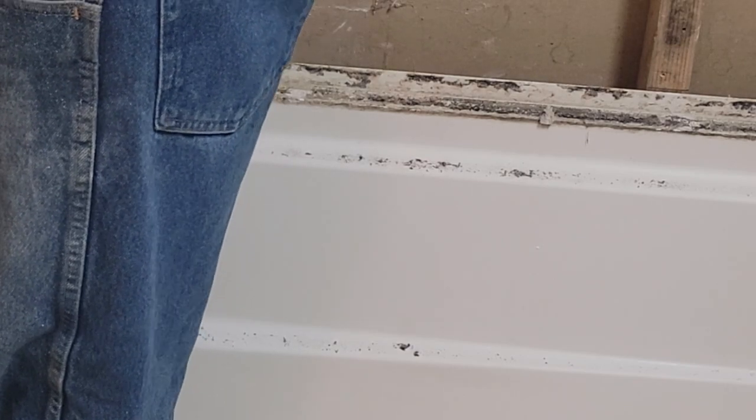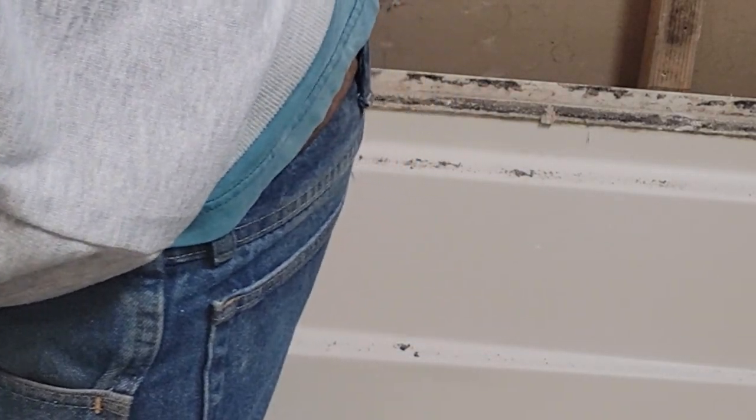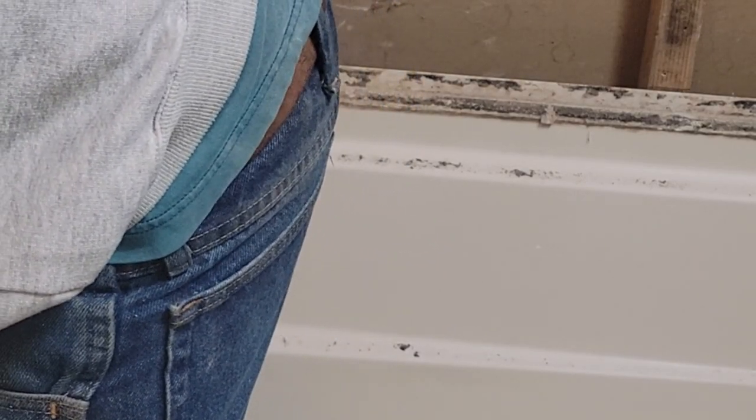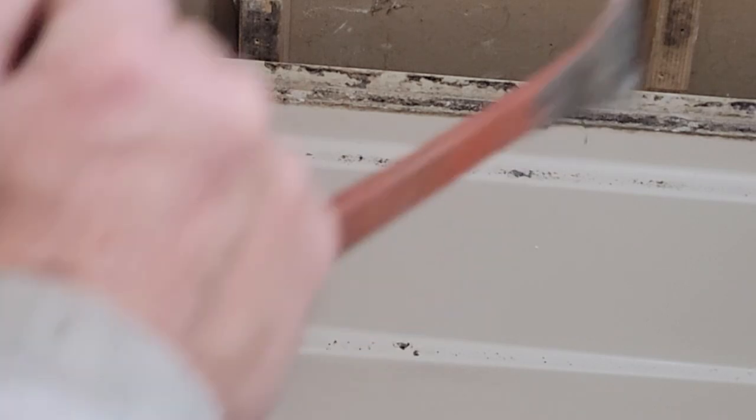Normally if it was just sitting on the floor it would wiggle all over, but we can see from the basement that this was mortared in. So I'm going to have to cut it out of here, which is a shame. That makes the walls of the shower not very useful now because they don't go to a non-mortar tub. Nothing's even budging, so it looks like I'm going to have to saw this tub up into pieces. I'll stay away from the water lines, the electric line — there's an outlet on that other wall, there's a switch over here.